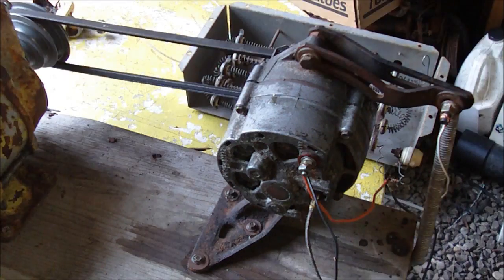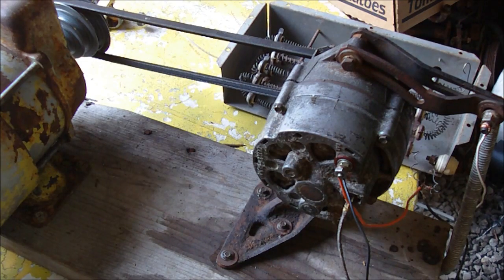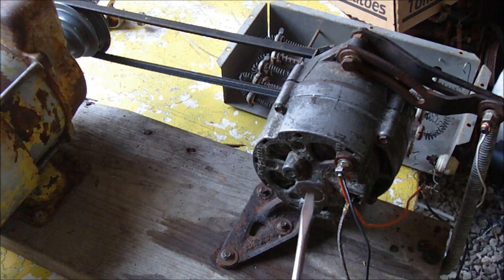What I want to show you about alternators is that you don't have to have a battery to actually make them work. I have a lot of alternators — ones with built-in regulators and ones without. This one was just laying around, it had a V-belt pulley, and it doesn't have the built-in regulator. With an alternator that has a built-in regulator you're going to have to do a modification, but this one does not have a built-in regulator.